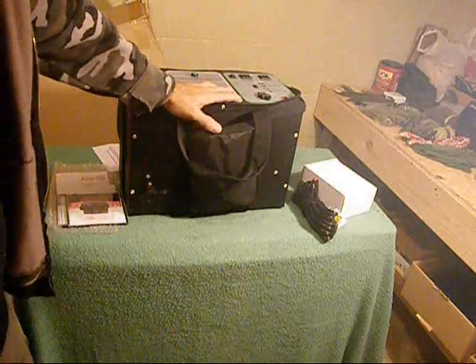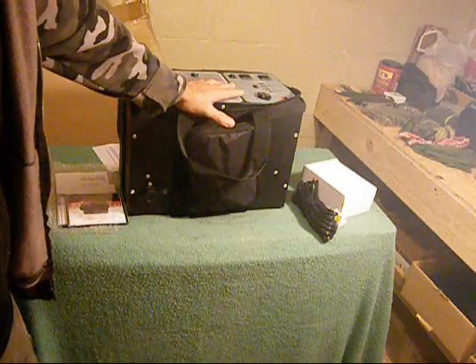It's convenient, quiet, light enough to carry around, and you can put it in your car and travel with it — no bad fumes, no sound. There are some downsides: if you're using a lot of power and drain the 50 amp-hours quickly, you might find yourself without power if the grid doesn't come back. But you have to weigh those options against dealing with a fuel generator. Other options include getting a second unit so one can charge while the other is in use, or keeping a backup fuel generator.